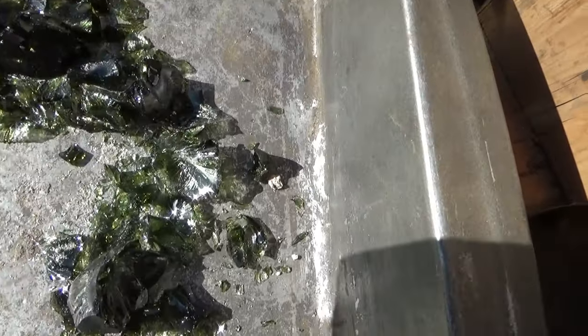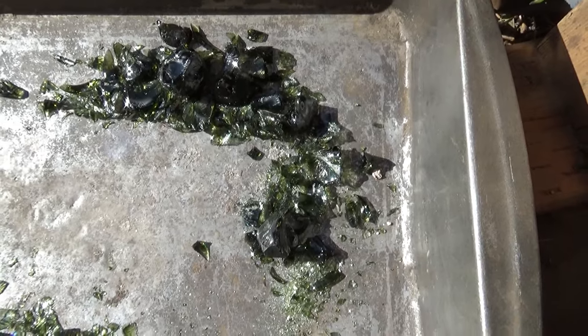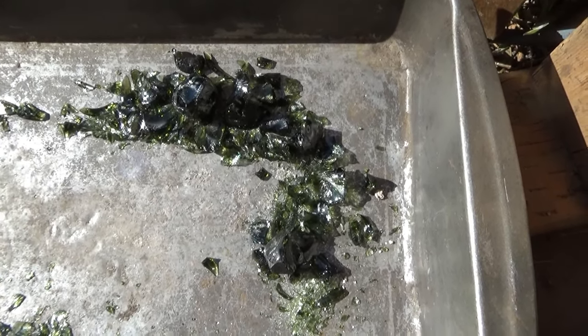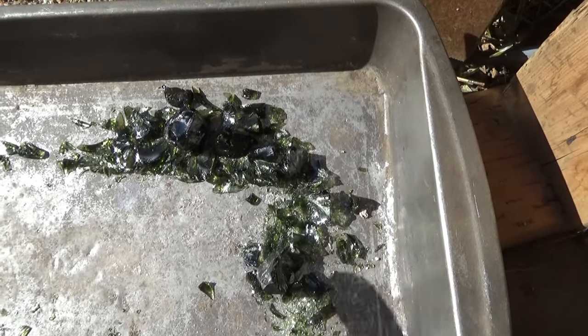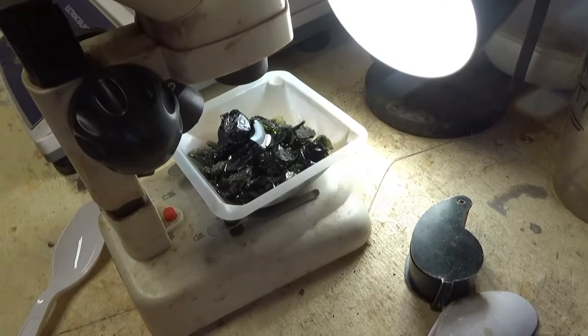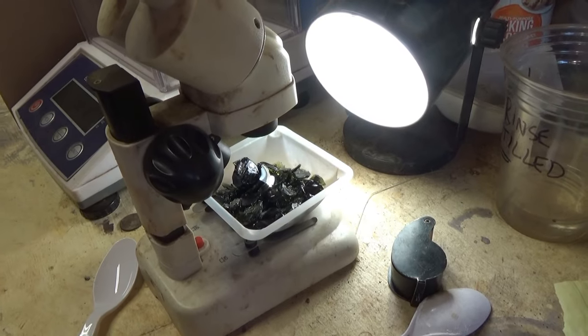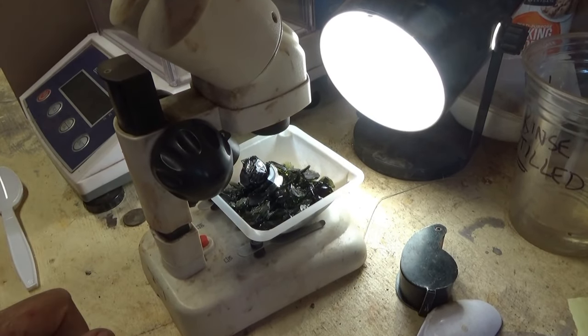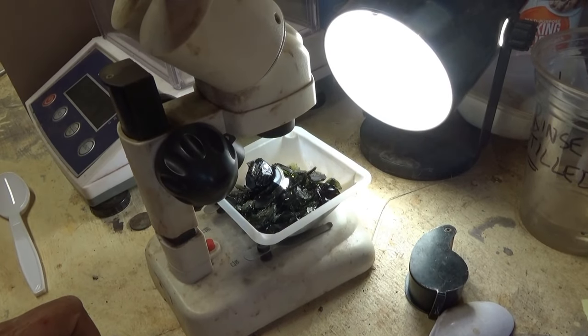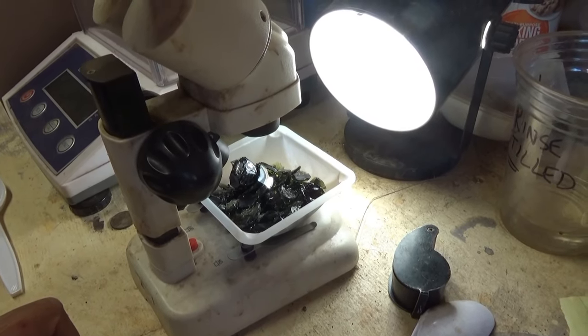You can see this got some beautiful separation — we got feathers and what I like to call radial fractures. A good pour will result in slag that fractures in a nice sunburst pattern. This is a very common color for good slag with the material that we've got. My slag is weighed and microscopically examined — what I'm looking for is how it broke, what different colors or iridescence may be in it, and whether there are any little microbeads of metal still left in there, which there were not. This is nice clean slag, and it's still reserved — I save everything.